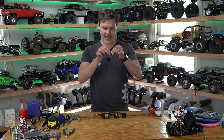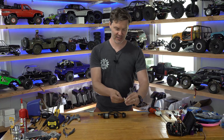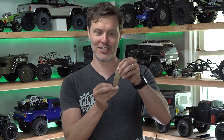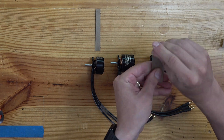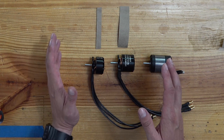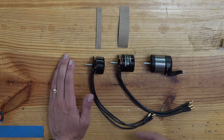This little stubby motor only has a 10 millimeter long stator length, but it has a 28 millimeter diameter rotor. So this is our flux gap area, and if we roll that out, there it is expressed in a flat plane. And then on the 540 revolver — a 20 millimeter long stator and 28 millimeter diameter rotor — that is the flux gap area rolled out into a flat space. Looking at these compared to each other, the bigger motor has a lot more flux gap area. In fact, it's exactly twice the flux gap area.